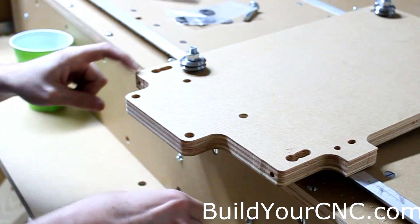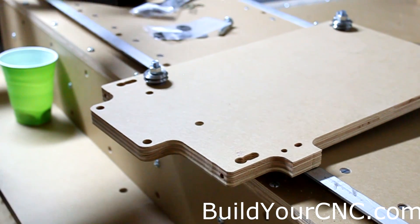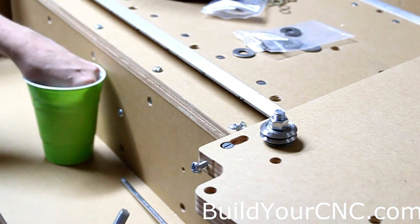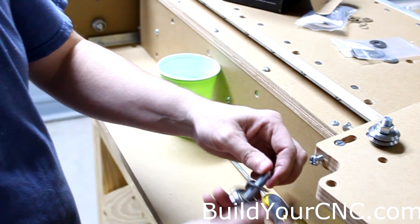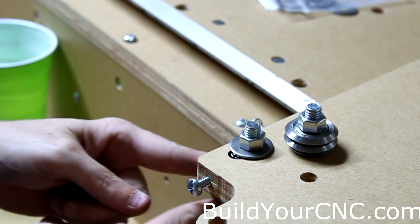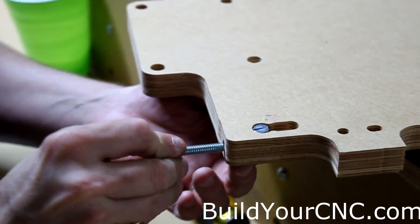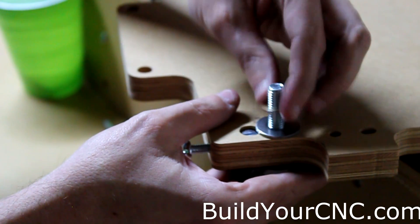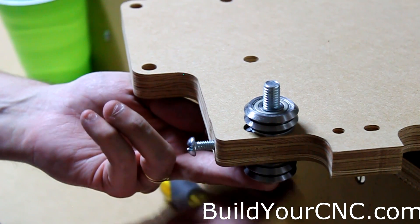These two are for the Y-axis only, to be adjusted against the Y-axis rails. We're going to start with a cross dowel and a 2.5-inch screw. We still want the 2-inch screw coming in from the bottom. Start with the bearing, since this is on the other side. A thin washer or medium washer put in the bottom, then another washer. For the final one, start with the cross dowel, put this one in underneath, put another medium washer, thin washer, and V-groove bearing. The screw goes in this way so it doesn't conflict with any obstacles in the back.